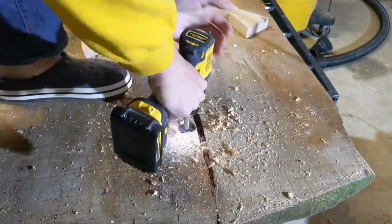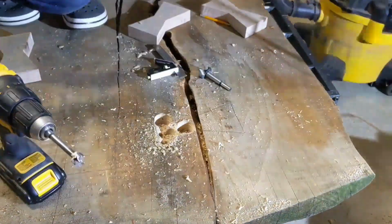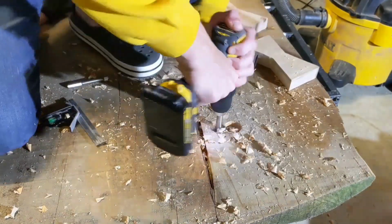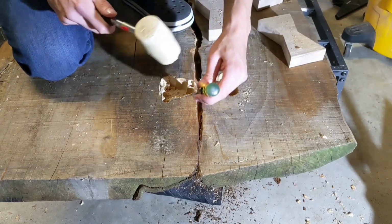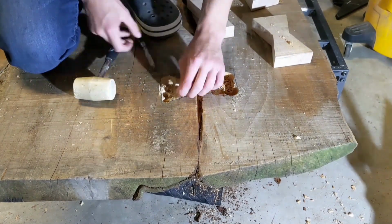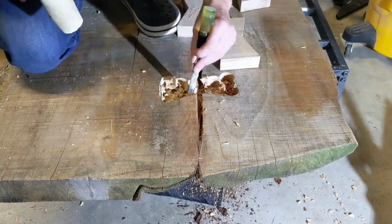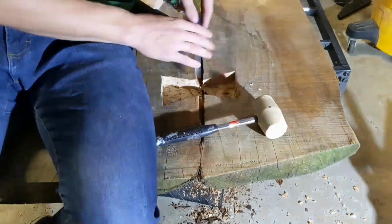As some of you may have already noticed, my method of cutting out the recess for bow ties is rather abnormal. Typically, one would use a router equipped with a straight bit and plunge it into the wood and cut it out that way. I have used that method for smaller bow ties, but because the bow ties I am using here were so very large, I decided to start by hogging out the majority of the material with a Forstner bit in my drill. After that was done, I could use a chisel to get the right shape. This took a good deal of time and wasn't perfectly precise, but luckily it was on the bottom of the table, so a very, very slight gap would matter not.